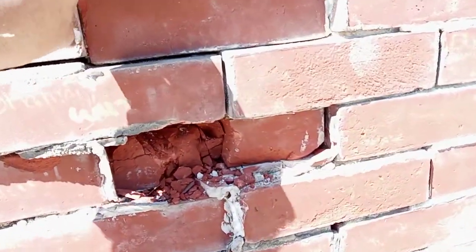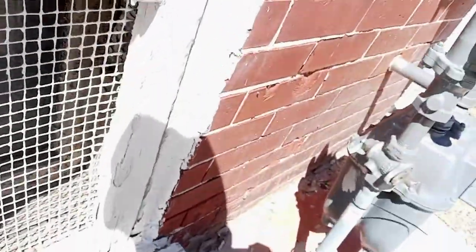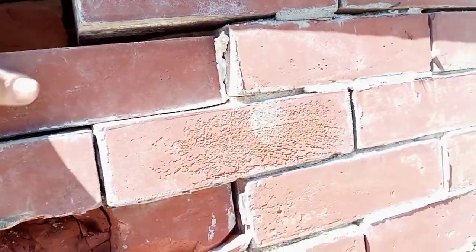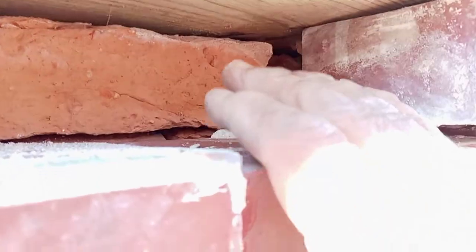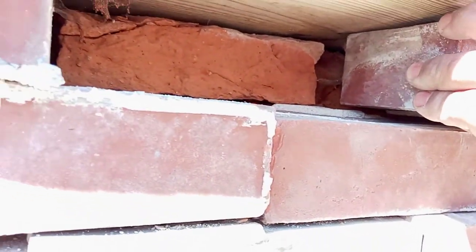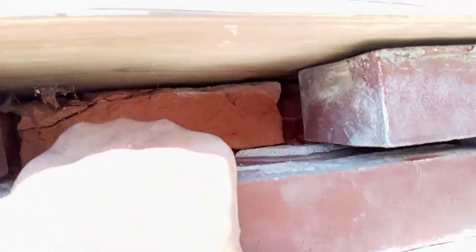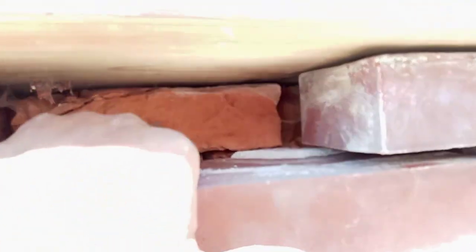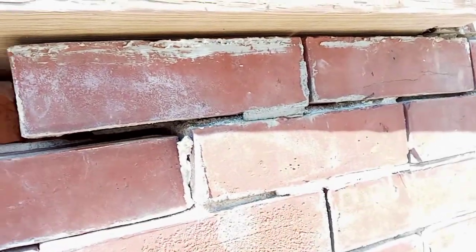Here are some loose exploratory bricks to get inside. Upon getting inside we discover there's another layer of brick — very porous in nature, as if water ran across it and caused a lot of deterioration. The owner then discloses: I'm explaining to him that it looks like a lot of water deterioration. He explained that there was a lot of water coming down from the roofline at one point, apparently getting behind the brick.